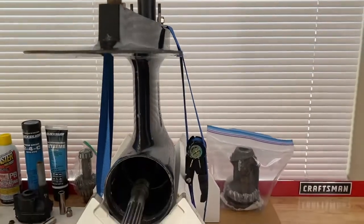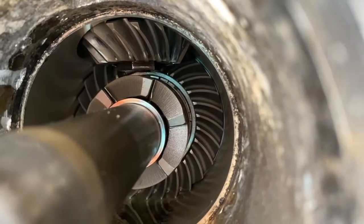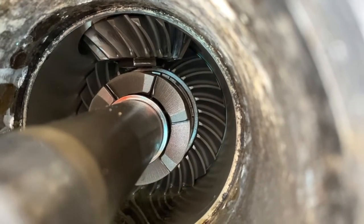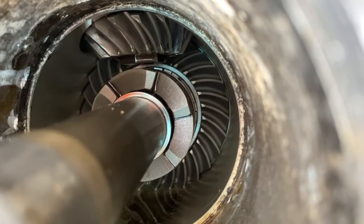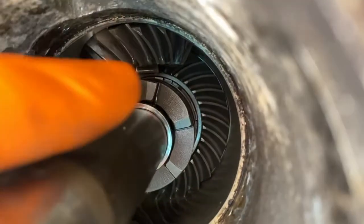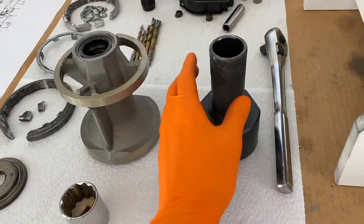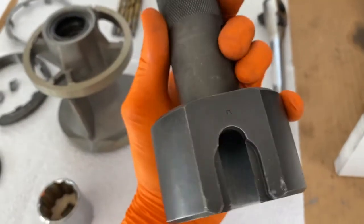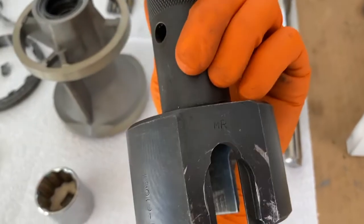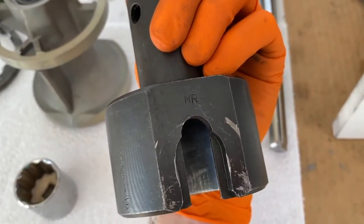Feeding off the top portion of the lower unit, we are going to go inside the lower unit. You've got the propeller shaft feeding into the clutch dog, directly above that is your pinion gear on top, and below that is your pinion gear nut — and we need to remove that. I've opened up this part right here. You'll notice it has MC1 and MR markings. Our unit is Alpha 1 Gen 1, and our specific serial number is an MR.